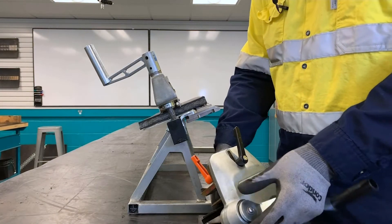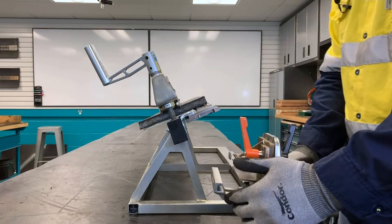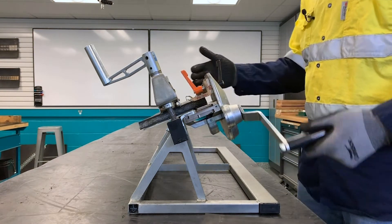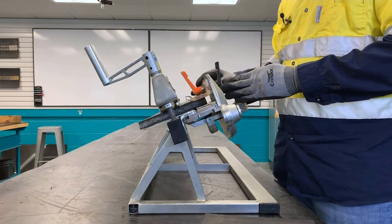I've already preset the Skiver to skive 2mm depth off the top cover. We're going to insert the Skiver onto the bed using the mounting brackets and engage the gears with the drive handle. We're going to position the Skiver 2 inches over the belt, making sure it doesn't come in contact with the blade.